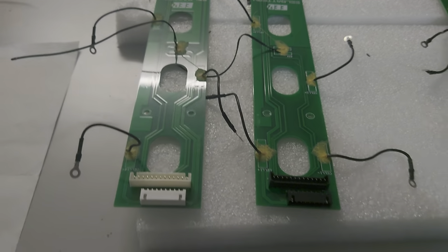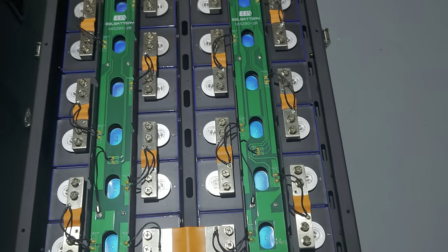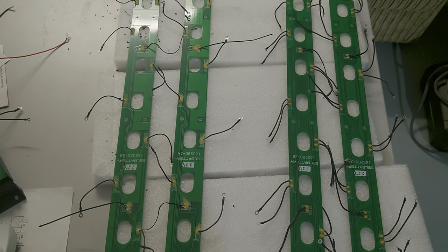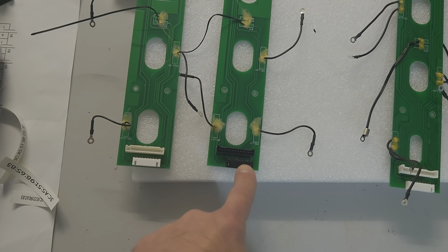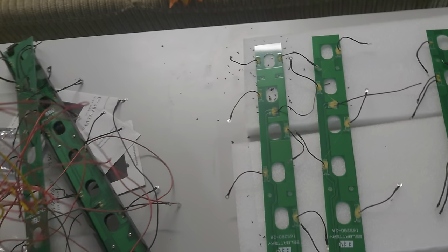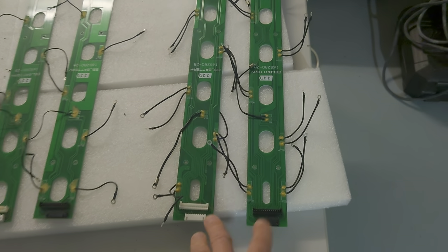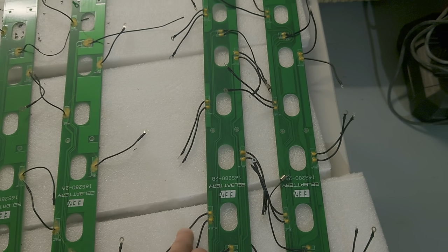If you don't use the active balancers with your cases, you're totally fine with the old style PCB balancing boards, which are usually mounted on the rails inside the case. But if you do have the active balancer, I highly recommend not using the balancing ports on the old style PCBs. Either get the harness connected — which is a mess inside the case — or get the new balancing port boards. And that's where I am now: since Saturday, the new balance ports arrived.